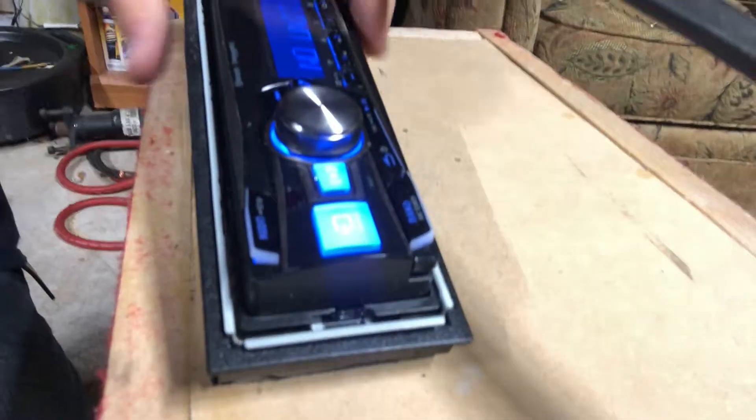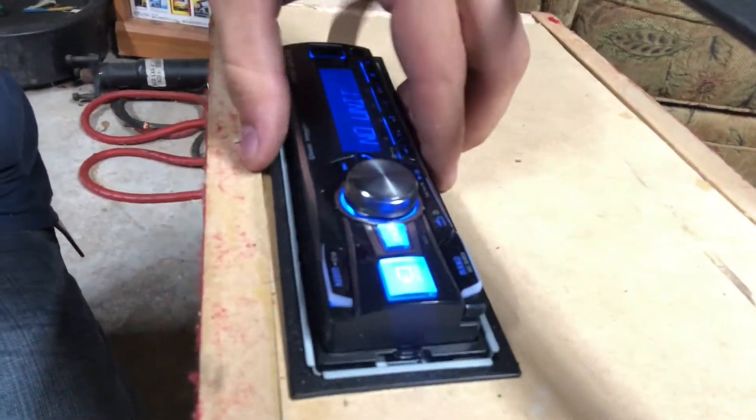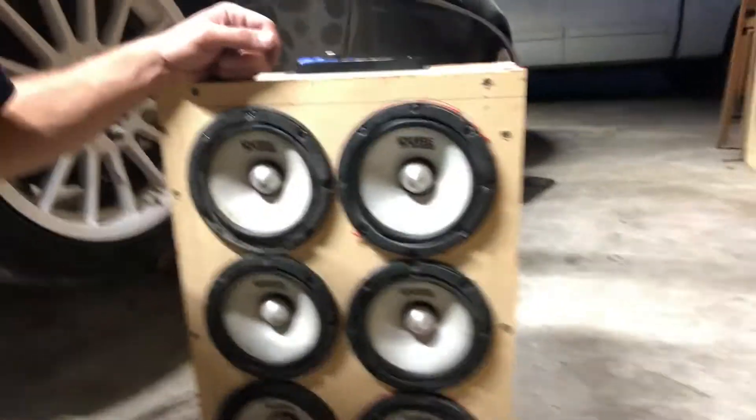It's kind of a jumble of wires inside, but the yellow wires go to the positive, the black and the brown go to the negative, and the other yellow and the red go together with the blue on the Xbox power supply side.